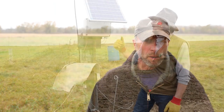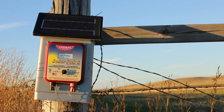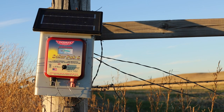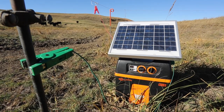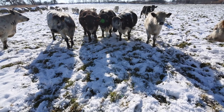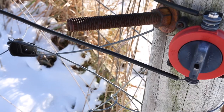We get a lot of questions on solar units — people are always interested in them. Essentially a solar unit is a battery unit with a solar panel; the solar panel functions as a trickle charger. They can be very effective in remote situations, but in northern climates where we have a lot of cloudy days late into fall and early winter, daylight is very short and temperatures are colder, so they tend not to perform as well. Any battery-powered unit, just like the battery in your car or pickup truck, tends to lose storage amps when temperatures get cold — we have the same problem on electric fences.